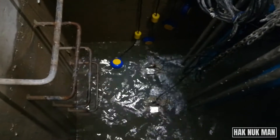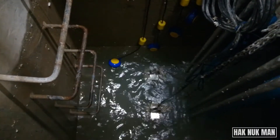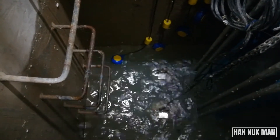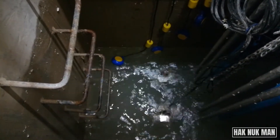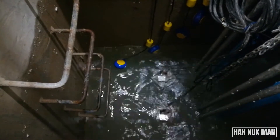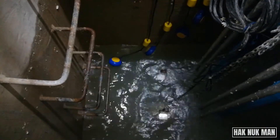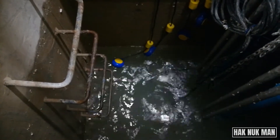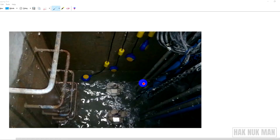There are also two submersible pumps in this irrigation tank. The purpose of the tank is to pump out all the water that flows inside this tank to the public irrigation or public wash water. Because this room is the pump room installed underground, we cannot use gravity, so we need to use these submersible pumps.